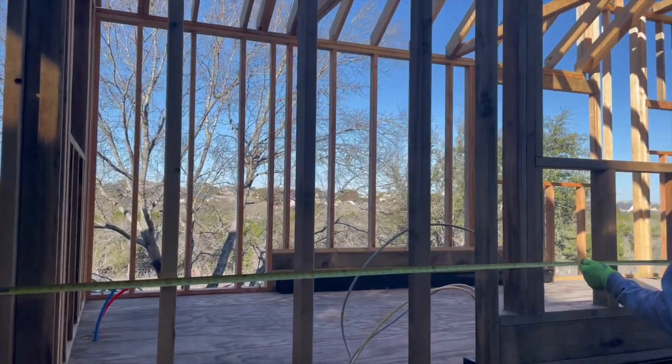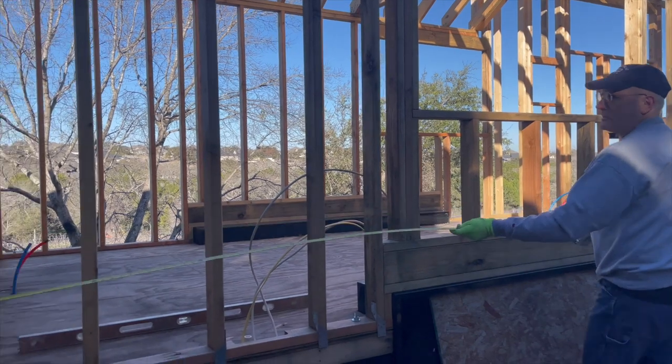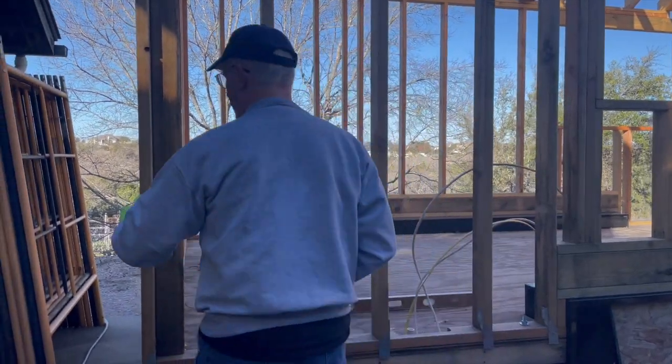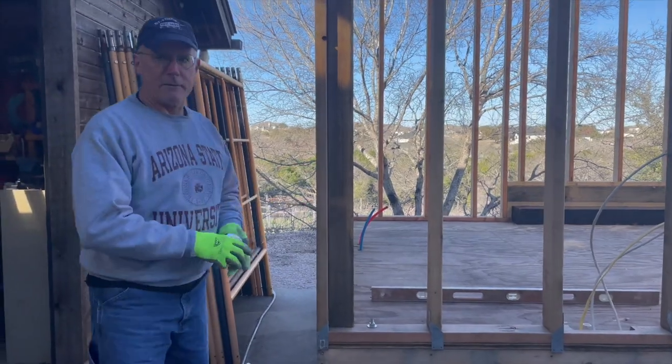And our strategy was to do the bottom corner of the side with the door first and make sure that was super straight, and then work off from there. A perfect 8 feet. And then that way the next sheet on this wall will bring it out the half inch to match that. Ah, nice.